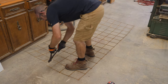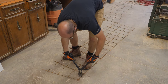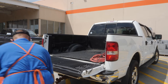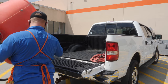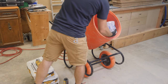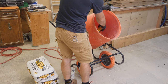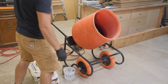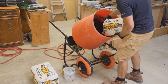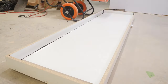To add some additional strength to the countertop, I cut remesh two inches smaller than the overall dimensions of the inside of the form. To make mixing and coloring the concrete countertop easier, I opted to use Home Depot's tool rental program and grabbed an electric mixer for the day, which made the project so much easier than using a five-gallon bucket and a handheld mixer. Home Depot has rental centers at most of their stores across the country. They also rent trucks, so if the materials or tool rentals you need won't fit in your vehicle, you can rent a truck and tackle your next project.